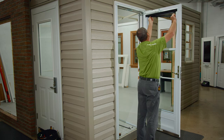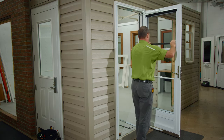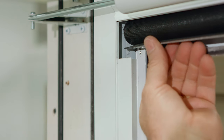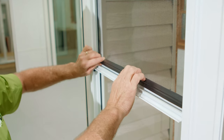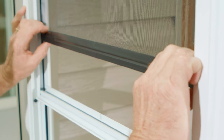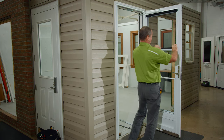Operate the screen, being sure not to let go, to check proper orientation and operation of the screen. Place each side of the screen into the grooves on each side of the frame. Pull down and attach to the sash. Provia Invent screens have a mark in the center of the bottom of the screen as well on the connecting rail to help ensure proper centering of the screen.